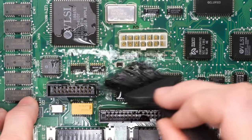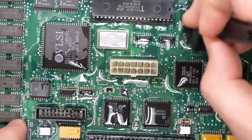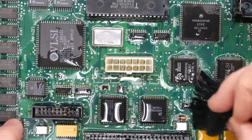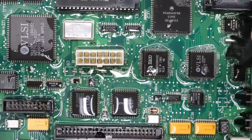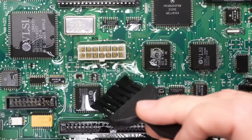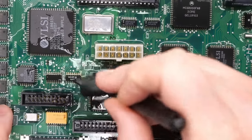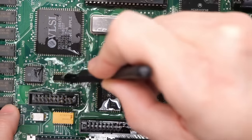And you wanna make sure that you sort those out first before you attach new components. Because obviously if you attach a new component, you're not gonna be able to see that there is an eaten trace underneath there once the new component is soldered back on. So you do need to try to fix all that stuff before you reattach any components. So inspect things with a little magnifying glass. And if necessary, you might be able to use a multimeter to tone out traces that go underneath these components just to validate that they work before you put things on.